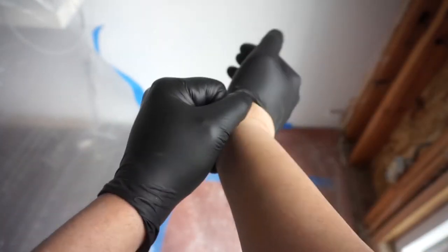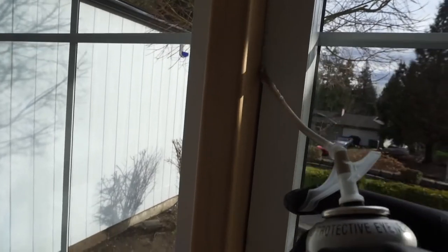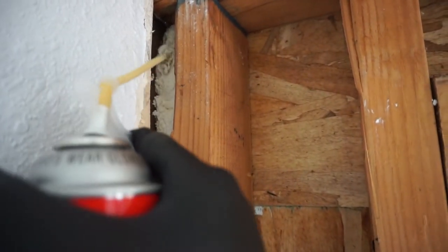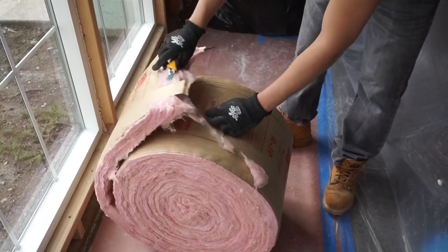Make sure you use gloves when you're using it because it gets really messy. It's really great for little tiny crevices like these ones. They come in different sizes for over one inch or less than an inch gaps. It's great for putting it around your window sill to eliminate drafts or any cracks, and just gently apply it around the windows — you can use caulking, but I chose to use this one. Here's a bigger void inside the wall; when it dries, give it about 30 minutes and then you can start trimming off the excess with a box knife. Be very careful — wear cut-resistant gloves. They come off just like this, and it fully cures in eight hours.